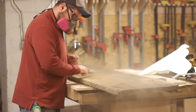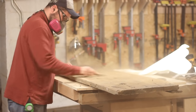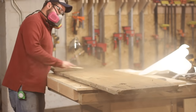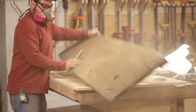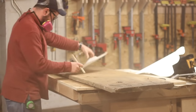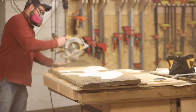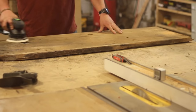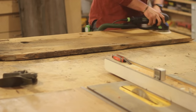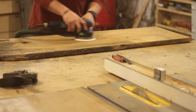I like to take a wire brush and brush off the wood before I mill it down - it just makes it a little bit easier when I get to sanding and I'm not causing as much of a mess as when I would just take the sander right to that dirty wood. You can see there's a lot of dirt on this stuff. I scrub and clean that off, and now here I'm laying out the letters, getting some rough sizes and cutting it down. Taking the sander to it now, you can see it's peeling away a lot of the dirt and grime and revealing that really cool wood underneath.